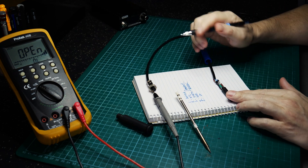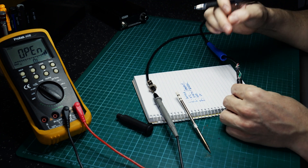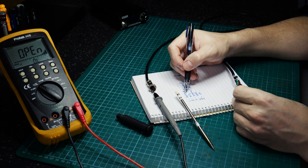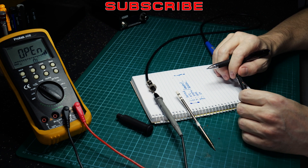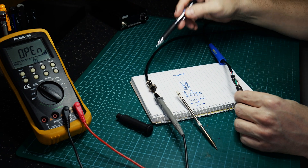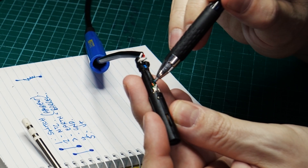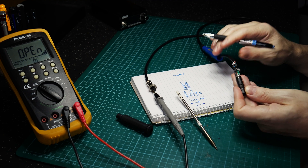To summarize: pin one and pin two connect to the top of the switch and the top of the NTC thermistor respectively. The switch is connected between pin one and pin three. The NTC is connected between pin two and ground — pin two and pin four. Pin two comes in from the plug into the top of the NTC, which is under a piece of heat shrink, and meets ground at the same point as the T12 connector.